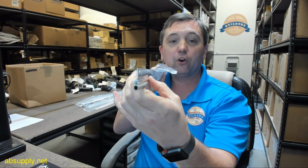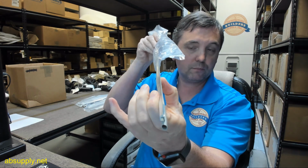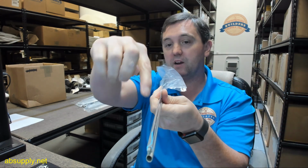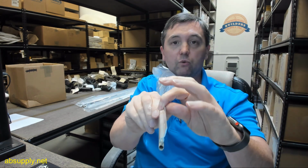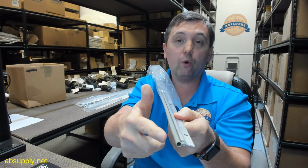What I mean is, I would probably opt for a thicker piece of aluminum. This one is quite thin, and I can make that flex. When I pre-drill these holes and secure it, I could get a very imperceptible amount of bellying between these two screw points, and because of the design, because cost is what's most important with this item, some water coming down the backside, I might opt for a thicker piece of aluminum. I would certainly opt for a higher caliber insert such as polyurethane or a silicone that Reese can provide you.